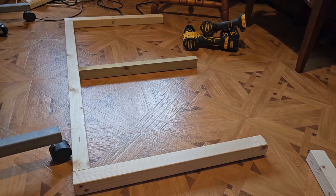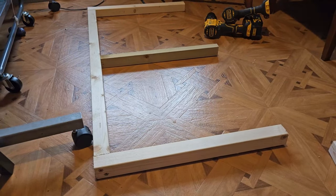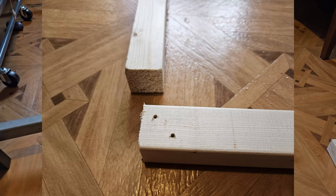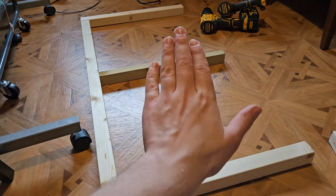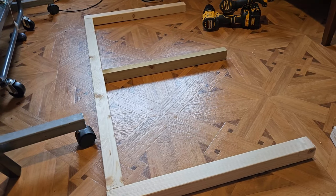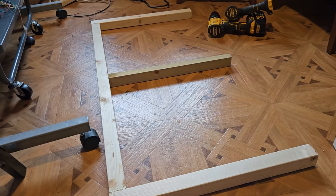So this is the basic framework for the lighting rig. I just cut up some timber — some 38 by 38 pine — cut it down to size and then glued and screwed it together, remembering to drill pilot holes for the big screws. Those are 70mm screws holding it together and it's nice and solid and square. It's going to be raised up above the layout, and there's going to be a finished piece of pine painted black and pinned to the front — that'll be the front fascia you'll see above.